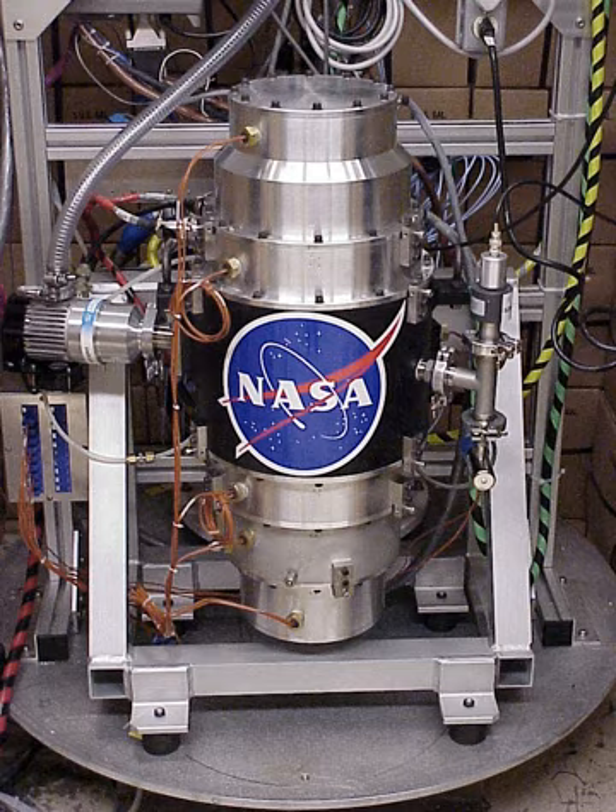For energy storage, materials with high strength and low density are desirable. For this reason, composite materials are frequently used in advanced flywheels. The strength-to-density ratio of a material can be expressed in watt-hours per kilogram or newton-meters per kilogram; values greater than 400 watt-hours per kilogram can be achieved by certain composite materials.